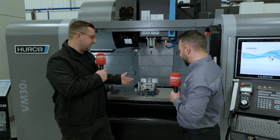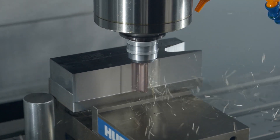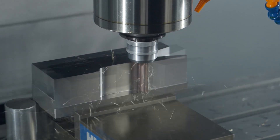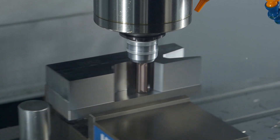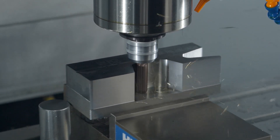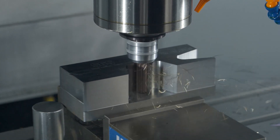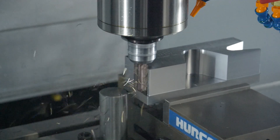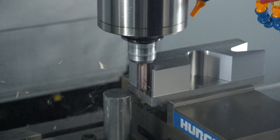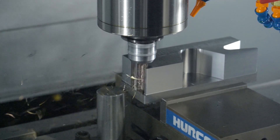The footage just shows how much power this machine's actually got — a 16mm 7-flute end mill absolutely ripping through steel. We're using our own adaptive path tool path to cut this particular demo. This one uses Adaptive Path One Way, which is more of a climb milling tool path. We're using an SGS 7-fluter in a Nikken tool holder.